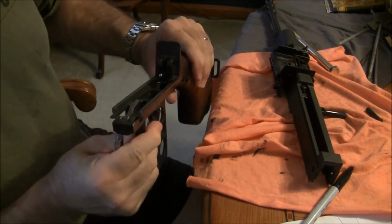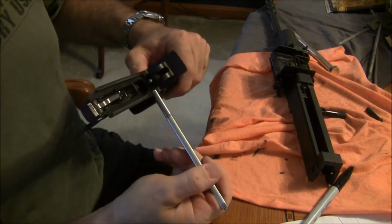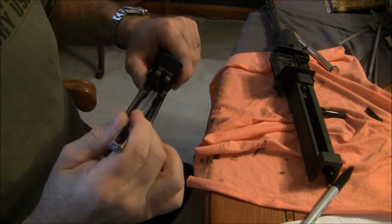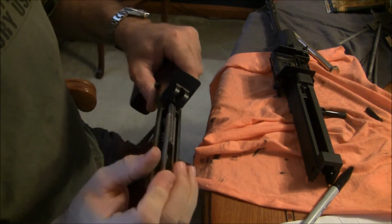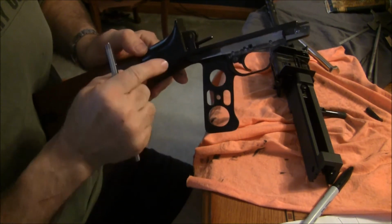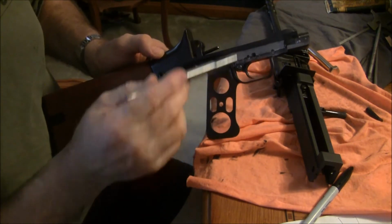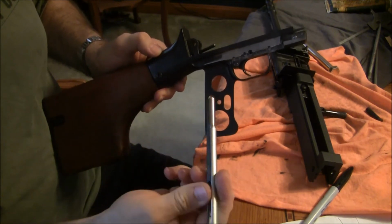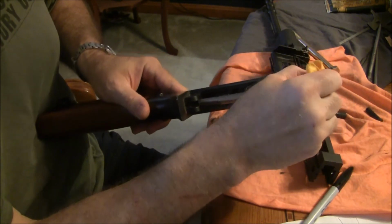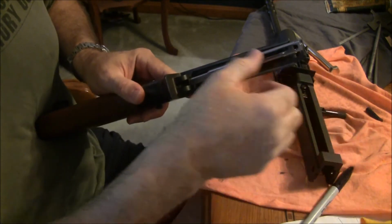Other mods for the grip frame to accommodate this push rod traveling back in here. This round hole that this passes through stock is opened up side to side and down. That way it facilitates the clearance of this traveling in and out. This hole comes through the back. It's on a slight angle, so it's easy to get a rat tail file in there. I used an end mill, dropped it down there, roughed it out. But I ended up taking just a rat tail file and cleaning it up where this passes through with no binding or rubbing. So the spring's pretty strong.